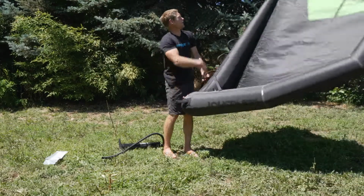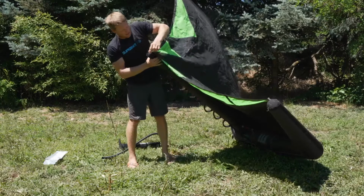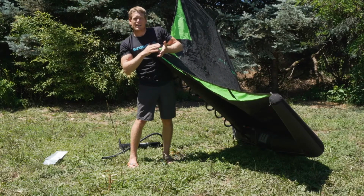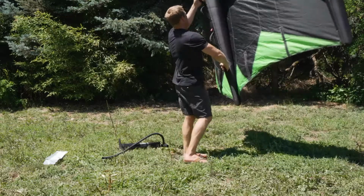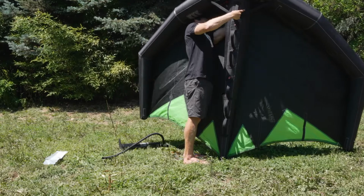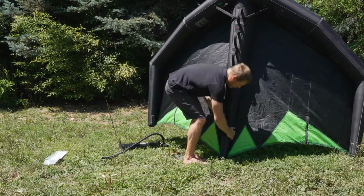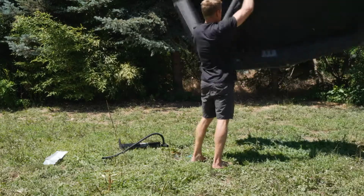I'm also going to come down here and I'm going to look at my end cap. Okay, everything looks like it filled out. It's got pressure in the end cap. There's nothing bulging out or looking like it didn't seat well, so that feels good. And then finally, I'll just kind of give it one visual up in here. Everything filled out really nice. No depressions around my valve. Strut feels solid. This thing is good to go.